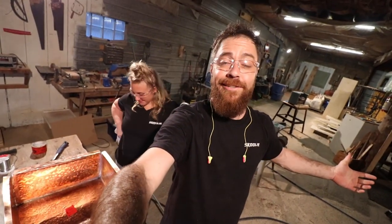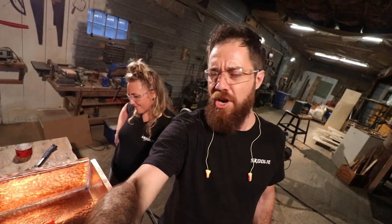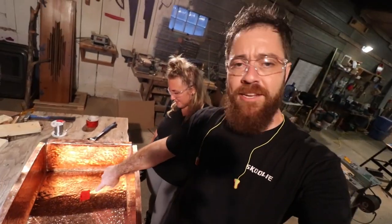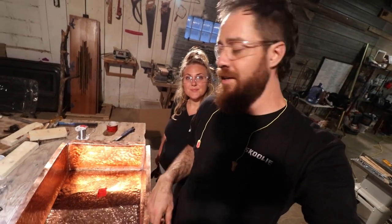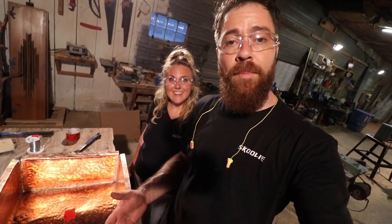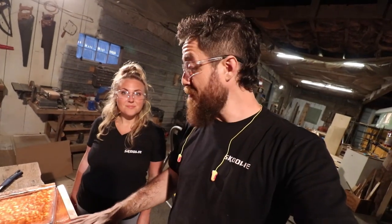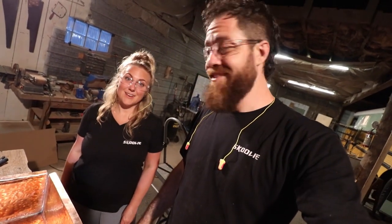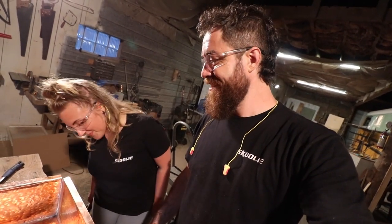The water test is simply, does it hold water or not? If it leaks, we need to reconsider our solder bits. Or brazed bits. So we're gonna fill this up with water, and we've got one hole where the drain's gonna be. We had punched a hole there just so that we can have a solid center on it. So we just put a little bit of tuck tape on the top side or the inside of the sink, and then also on the bottom, because obviously that spot's going to leak. So we got that sealed up, and now we're gonna fill it full of water and see what happens. Our handiwork was good. Let's go.